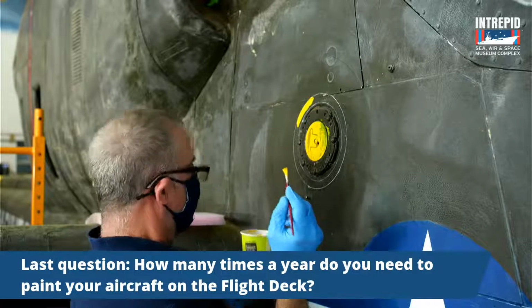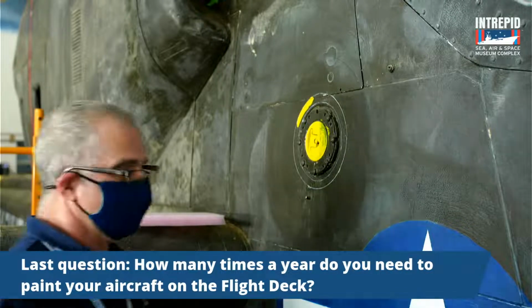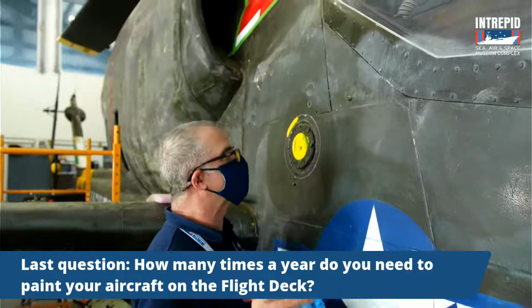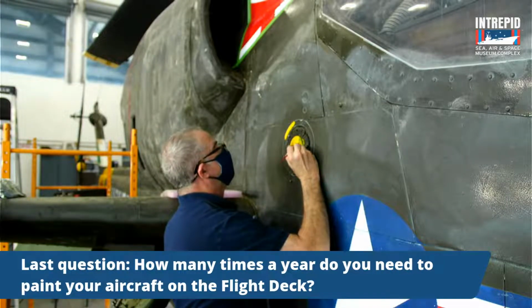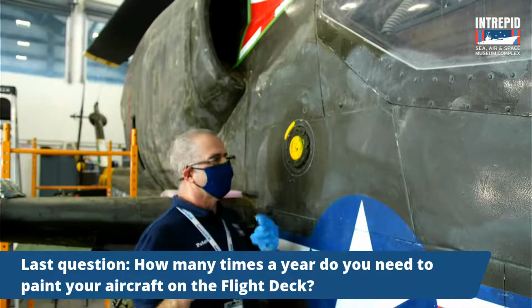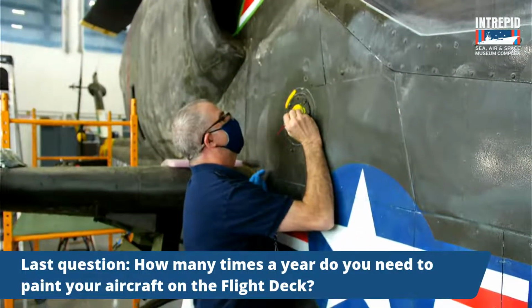All right, we have one last question, Peter. Let's hear it. Okay, how many times a year do you need to paint your aircraft on the flight deck? Well, hopefully, if a good enough job is done, it may be years. It all depends on the aircraft. There are so many variables when a coat of paint is applied. Humidity, temperature, if you're able to do the job in one shot or do part of it one day, part of it the next day. All these variables have a sometimes dramatic effect on how long a paint job lasts out on the flight deck.